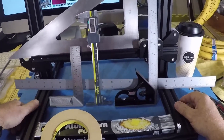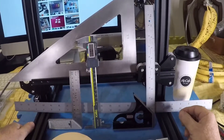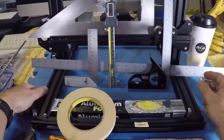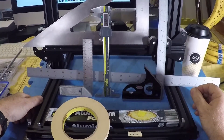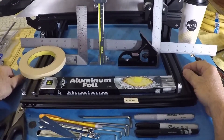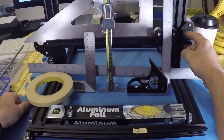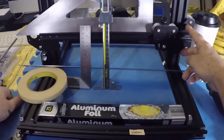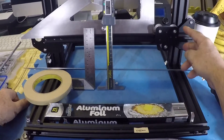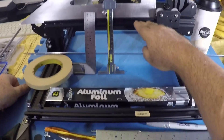If you watch the videos I've produced, you'll see why all of these tools are actually very important so that you can create a printer that will work and not give you the headaches that so many people come across. If you look on Creality Forum or 3D printer forums, you'll find a lot of people who are new at this — and I'm actually new also. I just did lots of research and have a little bit of a mechanics background. They're starting off bad by just putting it together straight out of the box. Things like the V-wheels and cut pieces need to be put on so they're perpendicular to the axis, and because there's so much play when tightening the Allen head screws, you can set things off by several degrees.